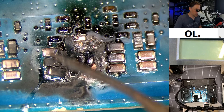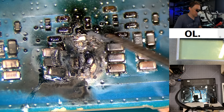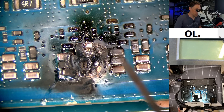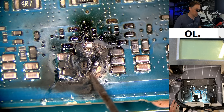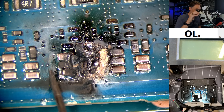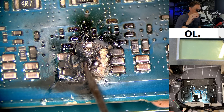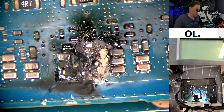We don't know if it's just a shorted capacitor — that would be nice — but we see a lot of residue here. Whatever component was here actually sprayed a lot of residue. What we don't want is the board layers to be ruined, and I can see that we have board layers kind of lifting here. We're going to have to clean this up before we start removing anything. There's a big pad here — I don't know if it's positive, negative, or ground. We'll clean that up. There's also a big solder ball. Let's measure — I imagine these capacitors are going to be shorted.